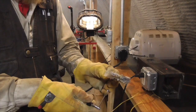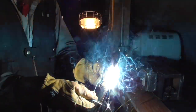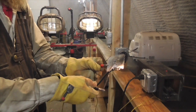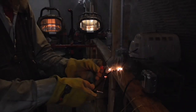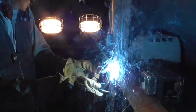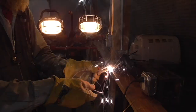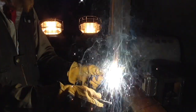Now, this in itself may not be all that useful because 16 amps at 120 volts is not really a good combination for arc welding. Most arc welders run at only 15 to 30 volts, but deliver 100 to 150 amps, or potentially a lot more than that if you get into heavy duty industrial applications. However, this does demonstrate that the work light is indeed functioning as a high power current regulator, which in turn is something that might be useful for future projects.